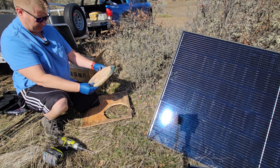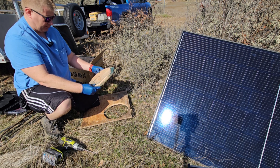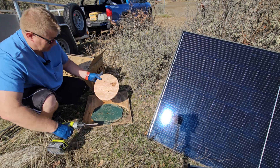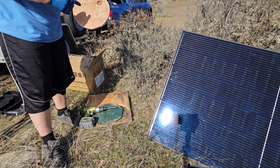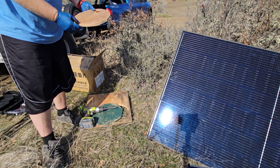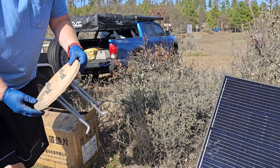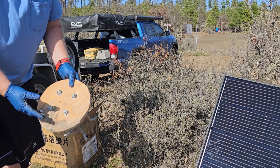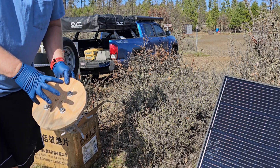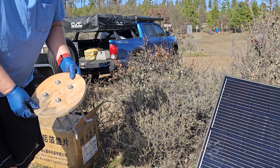I'm just visually confirming that this is approximately centered. It doesn't have to be perfect, but you want it to be reasonably close. So we have our holes drilled here. I'm going to get the U-bolts, measure them, and drill these out to the right size. Here's the template all done — the anchoring bolts are in. Just kind of marking like this works just fine. Usually on the base plate you might want to drill the holes a little bit larger just in case there's a little misalignment, which there probably will be. You don't have to get your compass out and start measuring stuff scientifically — this works just great.